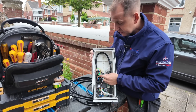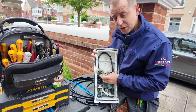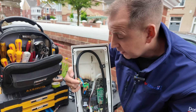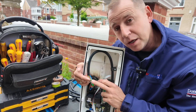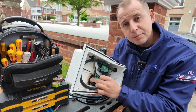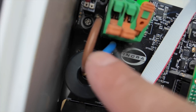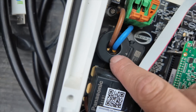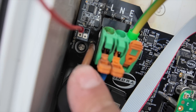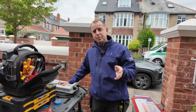Looking at this, we have these lever connections — that one's okay but these two don't seem to want to go up. Removing them, we can see there's definitely a burnt live conductor there, but it looks like the module behind is where the main problem is. Looking at the board, it looks like the line conductor which comes through this CT on that piece — I reckon that is where the problem originated.